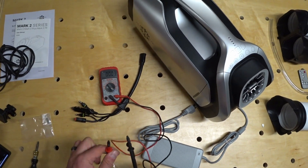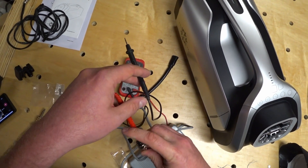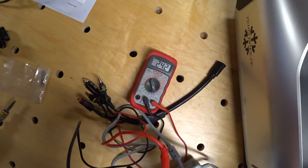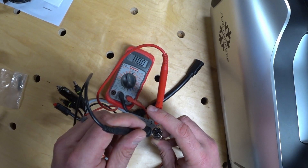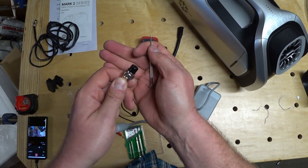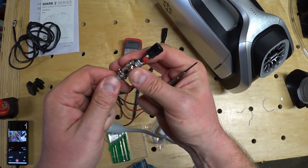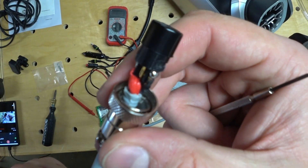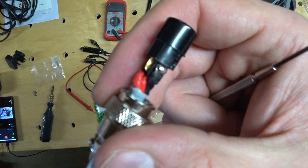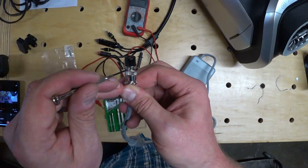For anyone curious, I had to open up this plug and see what was going on in there. Pin number one to number three did give me 24.2 volts. Inside it looks like we have four individual wires — two reds and two blacks. The reds are both attached to post number one, and both blacks are attached to number three. So now I know how to wire up my custom plug that I plan on powering through a 12-volt to 24-volt boost converter from my lithium battery bank.